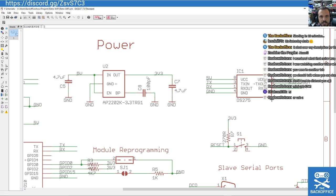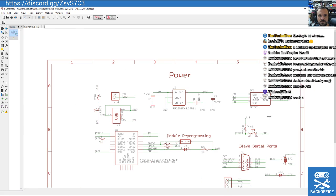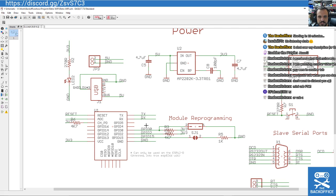They're deprecated, but they're basically chips to convert the levels, or the TTL levels, because you're interfacing with old hardware that needs the plus and minus 5 volts technically. And all modern hardware barely manages to do 3v3. Some of this is 1.8. So this is to convert the levels into the old school hardware.